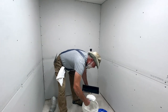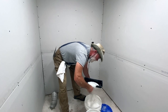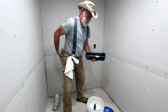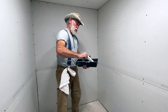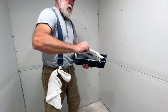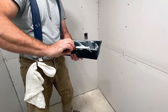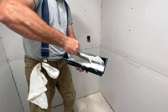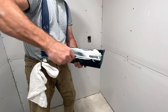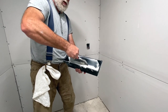I just need a tray to scoop up a good bit of mud. Mud is always easier to spread if it's worked. If your mud's starting to get a little too tight in the tray, you might add a little extra water or just mix it around a little bit — kind of like making a mud pie. You want to keep this stuff mixed up.